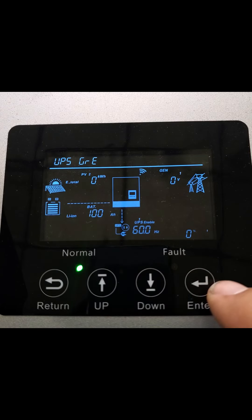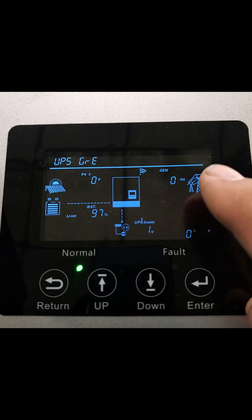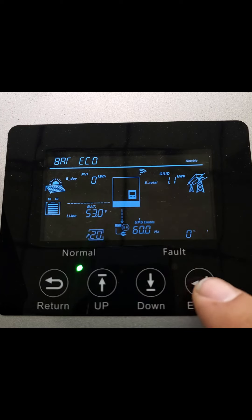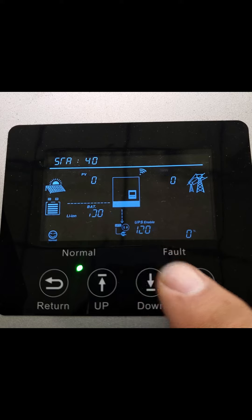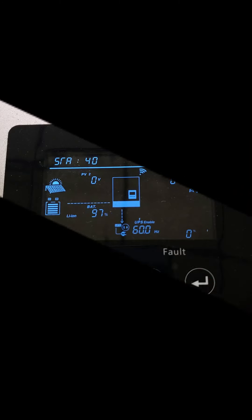When you have those set, it allows your system to go into a sleep of sorts, so it doesn't have any power going to the loads — that way you don't have a surge or anything. To turn those off, you'll go in and disable both of those features. At that point, you'll see that you'll be getting your 120 volts through your loads, and you can run your appliances and devices.